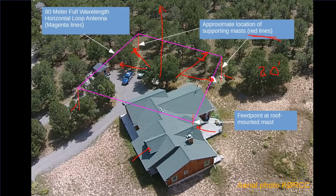For the antenna itself, I used a roll of 12-gauge stranded copper wire that I got from Home Depot. Yes, it's soft-drawn copper, so it does stretch a bit. I have to take up the slack now and then. I carefully tied each of the guy ropes to trees in such a way that the rope is above where anyone walking around the property might hit it, and yet it's low enough on that part of the tree that it doesn't bend much in the wind.